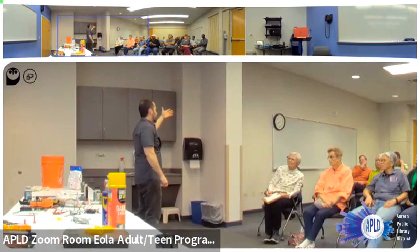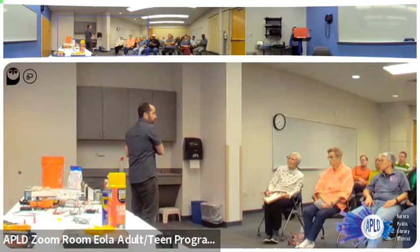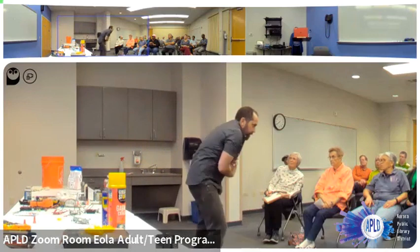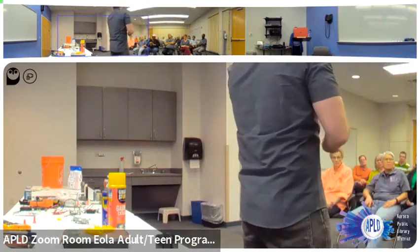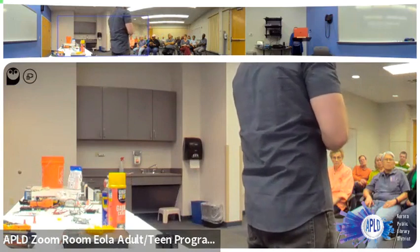A heat pump, in the wintertime, just switches that pump cycle. And it takes the heat from outside, even though it's 5 degrees, collects it. There's a little heat here, and a little heat there. Puts it in the box, brings it into the house, and lets it go. Okay? That's all a heat pump is. So it's just a reversing valve in a regular air conditioner, and a couple of bits and bobs.